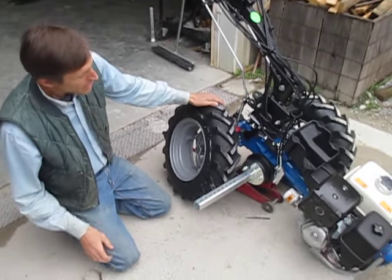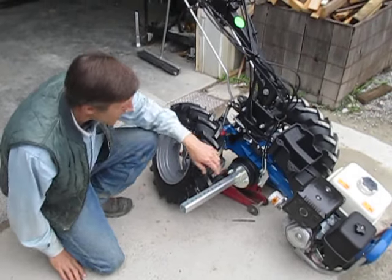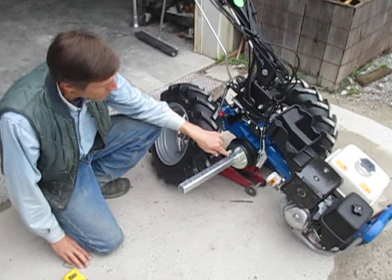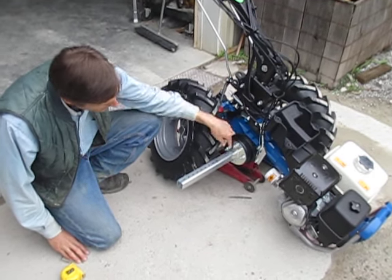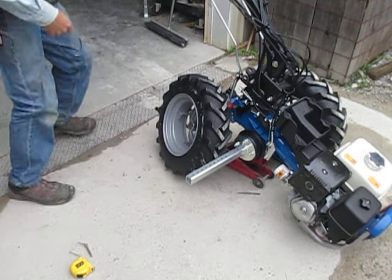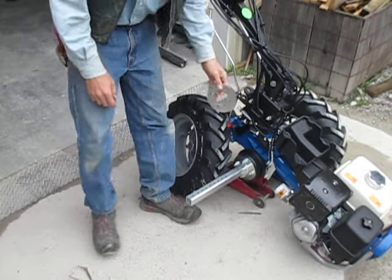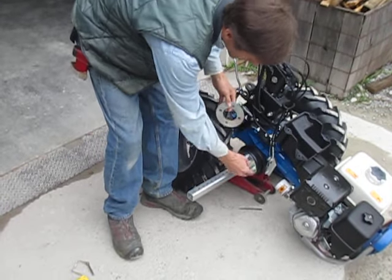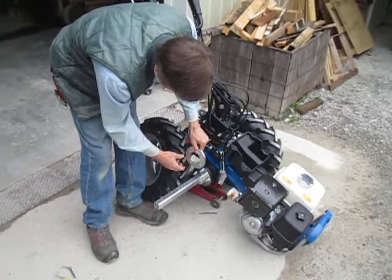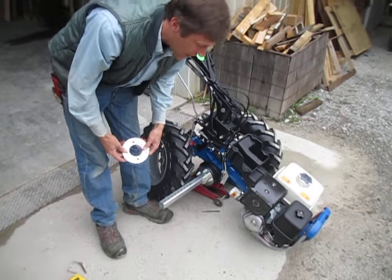Which isn't ideal for the rotary plow. And of course, this is just bolted right onto your axle — there's a brake drum there. Now if mounting these to a Grillo tractor, the Grillo tractor has a protruding bolt right in the center of the brake hub. In that case, we would supply these adjustable axle extensions with a spacer which would go behind this post — that is, before we mounted this to these studs, we would slip this spacer on there first, and that steps things off enough that we're not interfering with that inner nut.